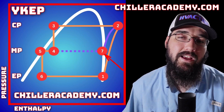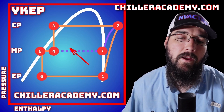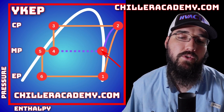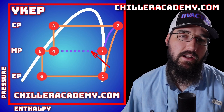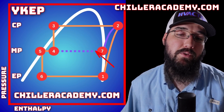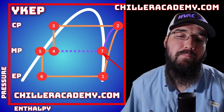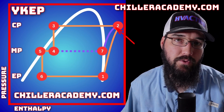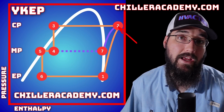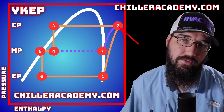Between point four and point seven, this is the secondary economizer compressor. The orange line is our primary circuit for the primary compressor, and the purple is our secondary circuit. We're not actually gaining heat when we flash off and move over into our secondary economizer compressor — that's why there's a dotted line here, because we're not increasing enthalpy between those points. But we are drawing in that vapor refrigerant, which is a pure vapor by the time it gets to the compressor. We then compress that vapor, it gets superheated through the compression cycle, and it's sent back into our condenser. The two compressors' discharge gases blend once they enter the top of the condenser and hit the distribution rail, and we begin to drain back down in our condenser cycle.